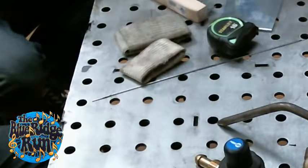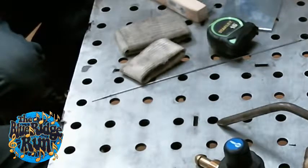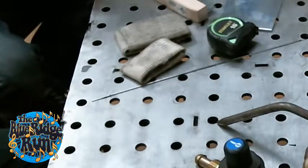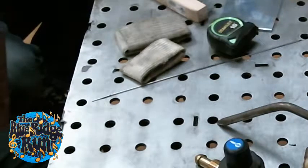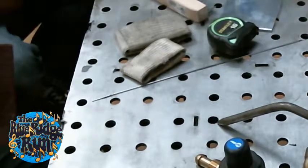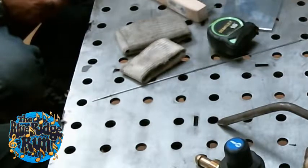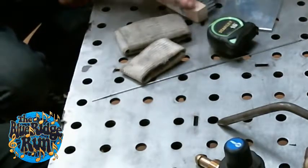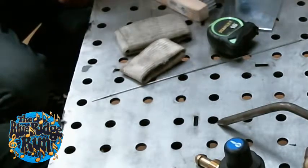And if you don't have that valley created by the bevels, and you go to grind your weld off to make it look like one piece, you don't have anything there. Especially if you didn't purge it and you didn't add filler rod. I've seen it done where it's been fit up, they fuse weld it, and then DA it and call it good. You hit a bumper, and there's nothing there. So that's the purpose of the bevel.